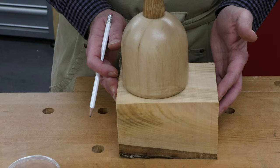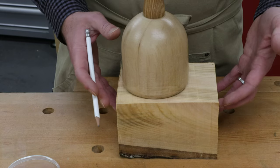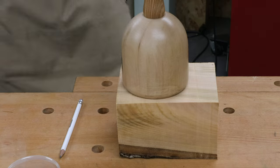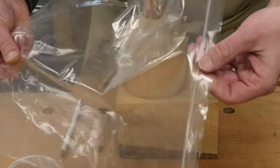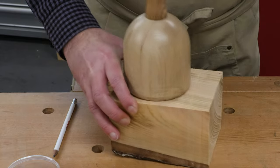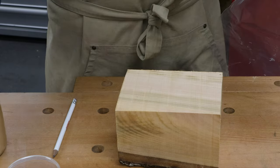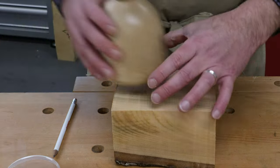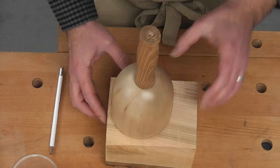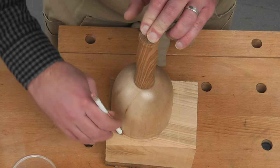If you cut a blank like this, it's really important that you keep it airtight while you're working on this. If you're not going to do it in one hit, make sure that you've got something like this, a little Ziploc bag, a polyethylene bag, that you can just pop your blank in to keep the moisture in it, because we don't want this drying out and splitting, especially once we've got that hollow in there. Make sure you've got a bag if you're doing this from wet or green timber. We check the end here for splits and cracks, and I'm just going to literally draw around this